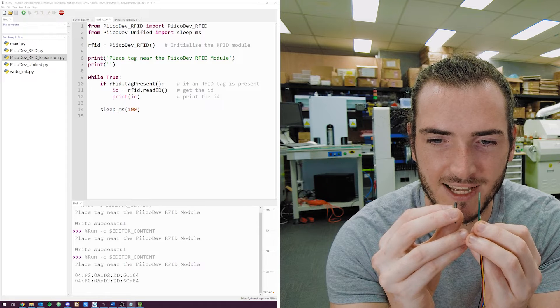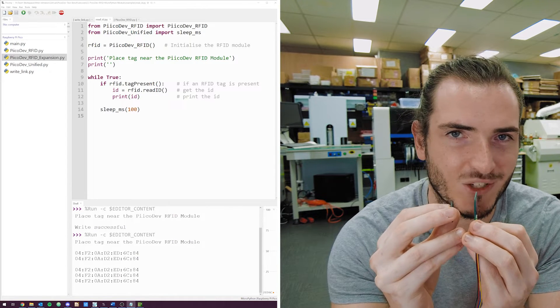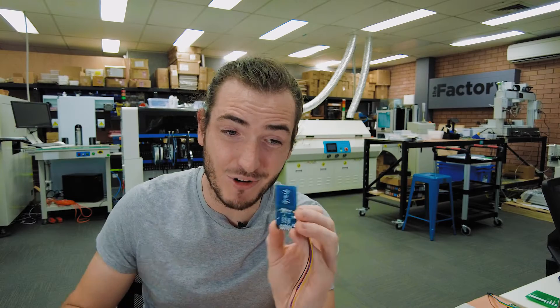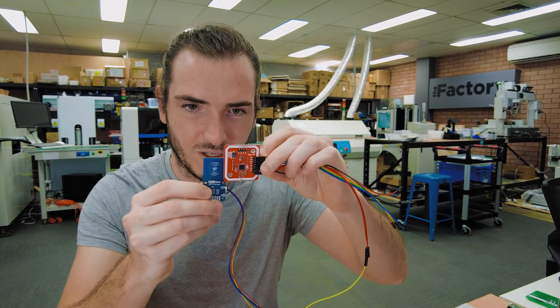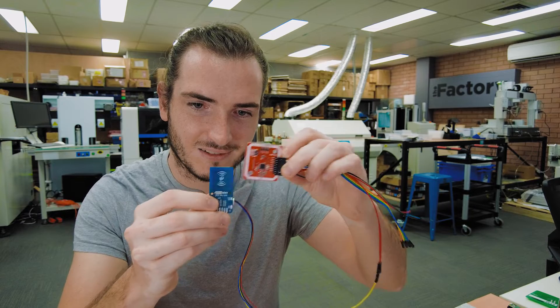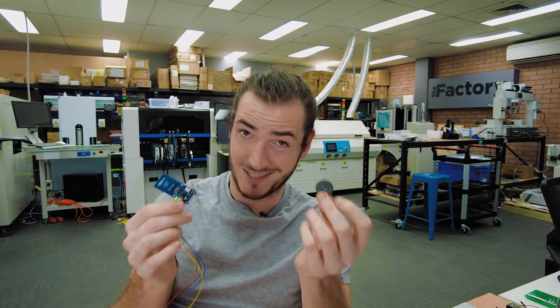Here's the kind of range we can get — I'll bring the tag just to the edge of its range and that's about 25mm, which is pretty impressive given the size of this coil. We got about 25mm out of a module whose coil area is about four times smaller than generic modules, so that's a win. NFC tags are very versatile; this project was my first real brush with URIs and it seems like you can do some really powerful stuff. That's all for today — let us know on the Core Electronics forums if you have any questions, and thanks for watching.